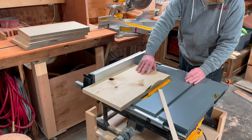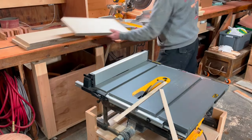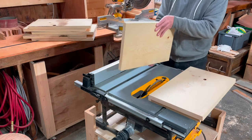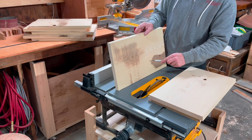Then I'm going to cut the boards parallel and at the same time to a 10 degree angle that provides the planter with a flat top and bottom edge. I also marked the inside and the top of the planter — I want to have the nice side facing out. That comes in handy when I start cutting the compound miter to all four panels.